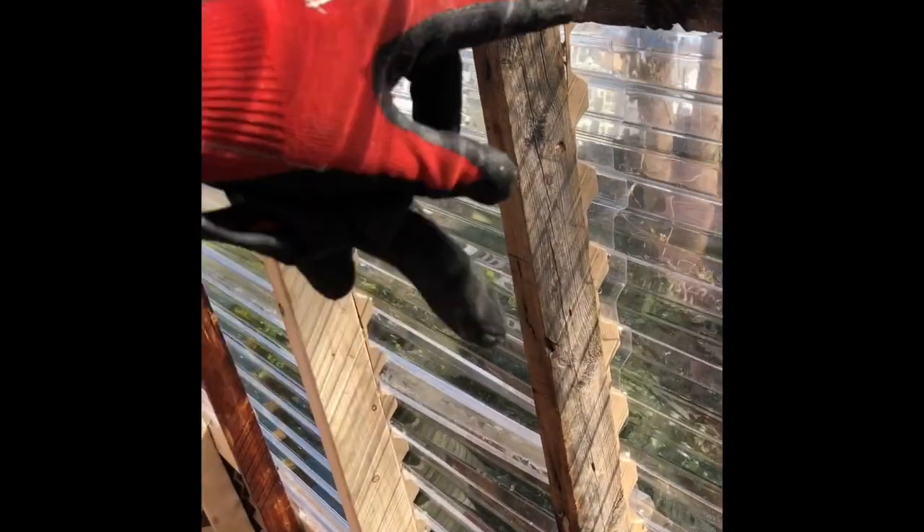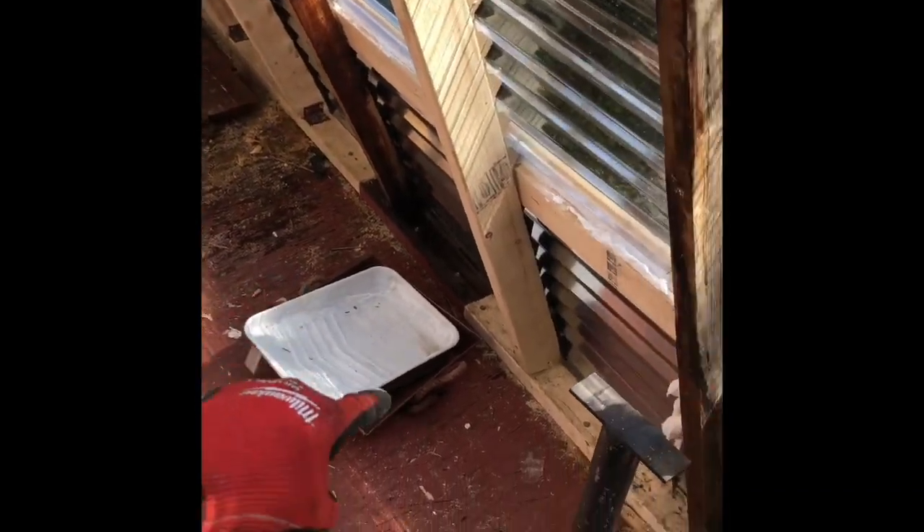In the rain I went up the ladder — first I was too lazy to get the ladder, balanced on an old tire, and unscrewed it, then made it flush so the rain would now run down properly. There was a big gap because I'd had the panels facing the wrong way — a rookie move. So I took it apart and installed it correctly. Next time it rains, knock on wood, it should be good. I did not anticipate the entire frame on the bottom being completely shot — the wood was essentially just breaking as I took it apart, so I replaced all the beams and support beams.